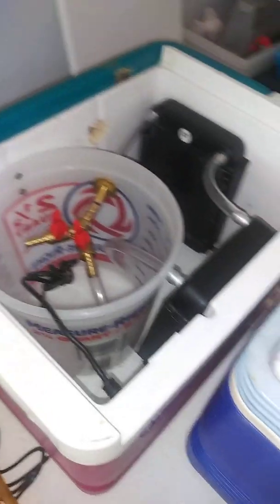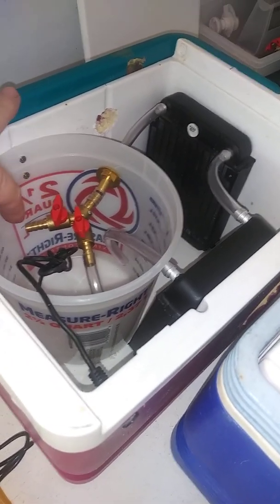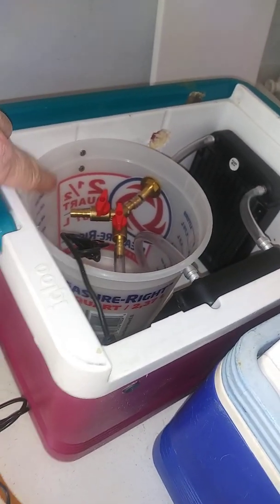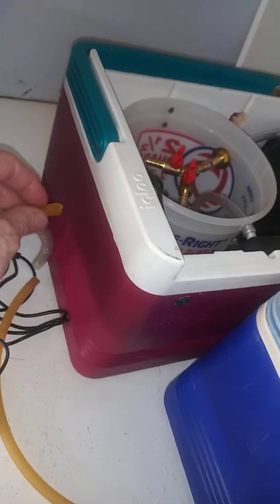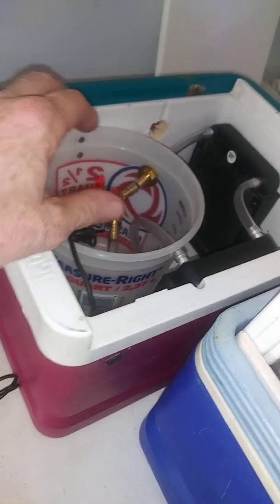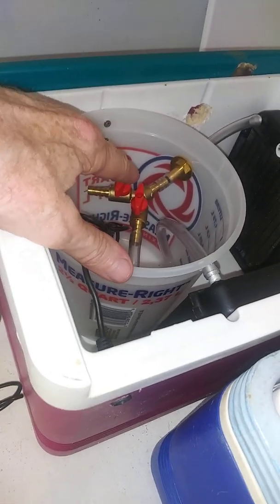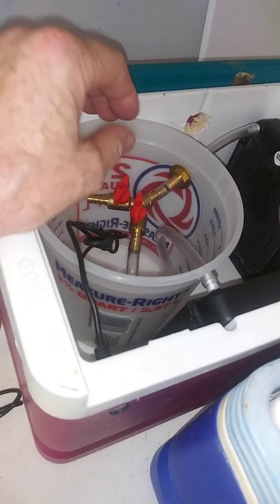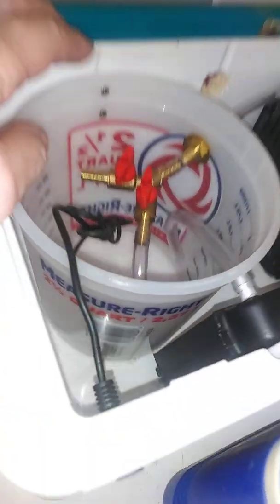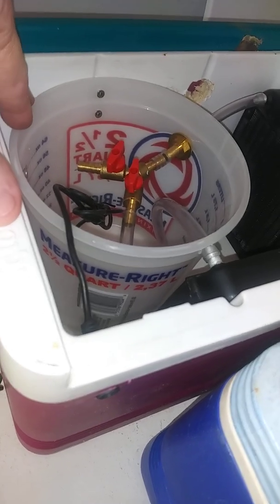This unit I'm working on is an open loop, but I'm adding a secondary port to run through the side of the cooler — I had the port there — to run through another bulkhead, so you can run tubing from the outside of the cooler into a five-gallon bucket or 48-quart ice chest or something larger. I did a test earlier on an open loop version, and the ice melted at about 15 minutes. Mind you, this is a little tiny bucket full of ice — it lasted 15 minutes and cooled for at least another 15.